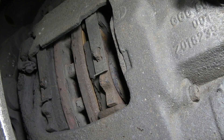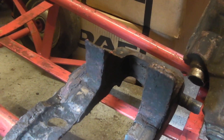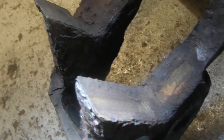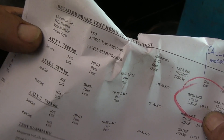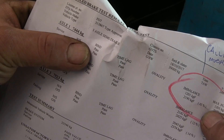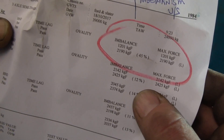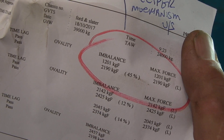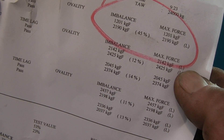Back to brakes. This is quite a common fault on any type of caliper system where the caliper works okay to a point but the pad will get stuck in the carrier. There are two things that can happen: where the pads sit, you can have a really deep rut and the pad will not go over that edge - as you can see, there's the rut. Or you can have a massive amount of corrosion or filth which will also hold the pad. We check brakes quite regularly - axle 1 is at 7.5 tonnes. It hasn't passed on here because it has quite an imbalance with a big difference in brake pressures from one side to the other. In an MOT you would fail on something like this because your calipers wouldn't be working properly. Other figures here say the calipers are working fine - this paperwork is from a three-axle trailer.